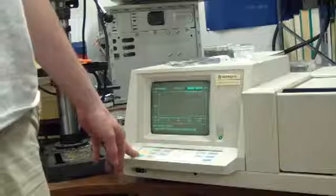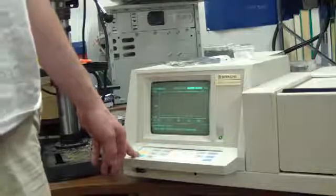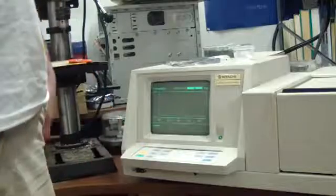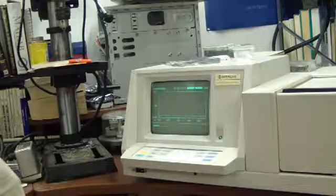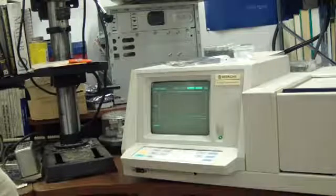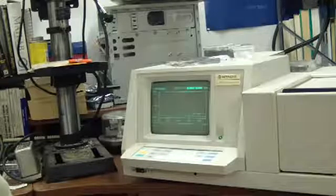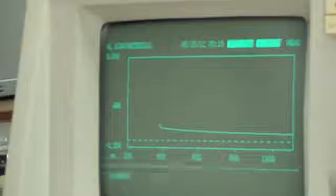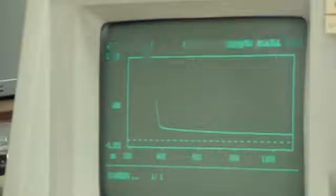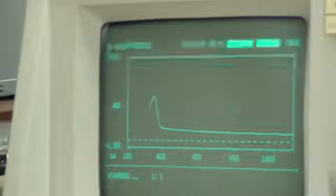We're going to start this right now. I have a piece of plexiglass in the sample chamber which still has the protective coating on it. There's a 5-second delay prior to scan. I have noted a little bit of a blip about 350 nanometers — I believe one of the filters has a fingerprint on it. And there's the ultraviolet lamp.